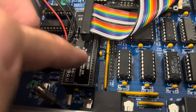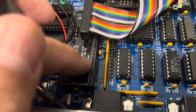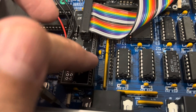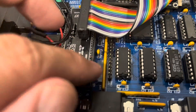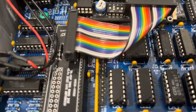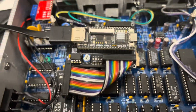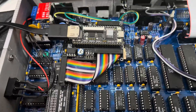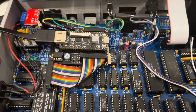I couldn't find them on DigiKey or Mouser either. These shrink DIP connectors are 1.77mm apart instead of 2.54mm. It's very similar overall; I just had to change how the clock is selected because it doesn't have an external clock here. And the results are quite impressive.